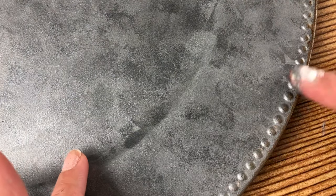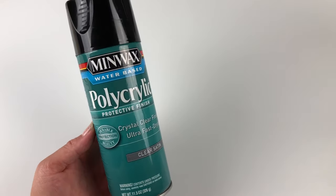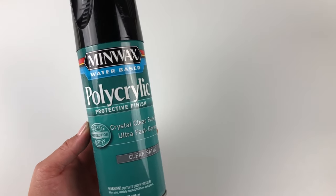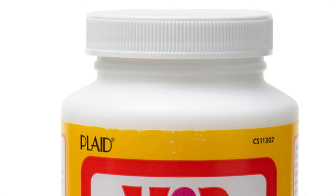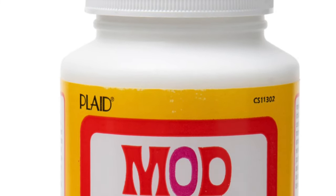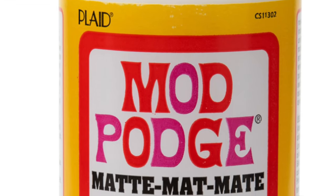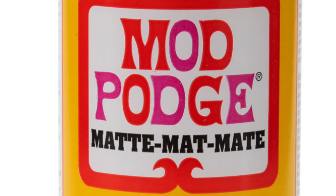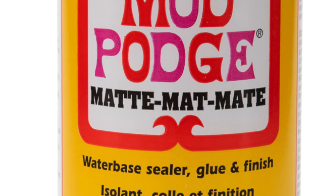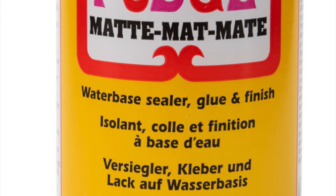Once that was dry, I wanted to give it a clear coat to prevent chipping, so I used Polycrylic Protective Finish in a clear satin. However, if you don't want to use that, you can totally use a matte finish Mod Podge. This goes without saying, but I feel like I have to mention — neither of these sealing options makes this food safe. This is for decorative purposes only as far as the chargers are concerned, so always make sure not to put food on them.